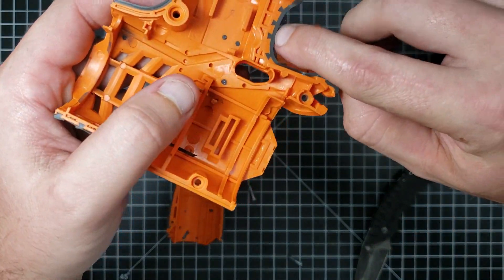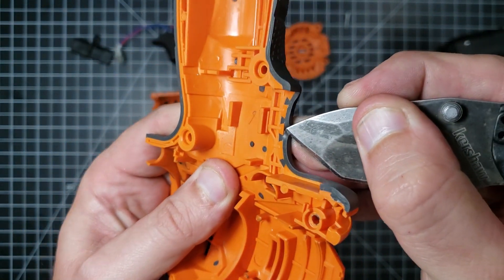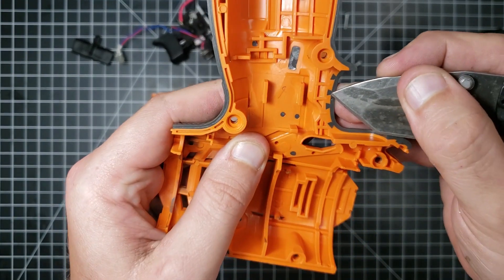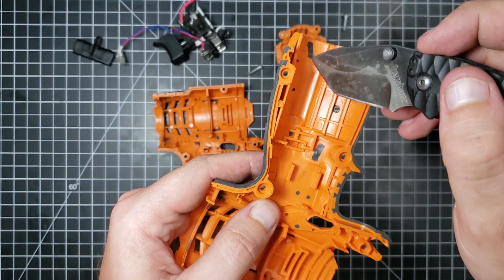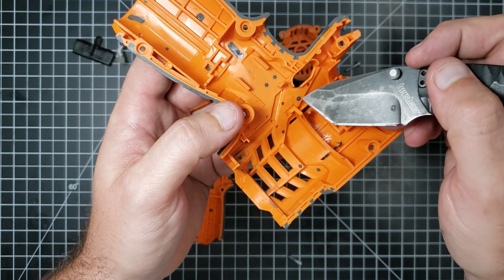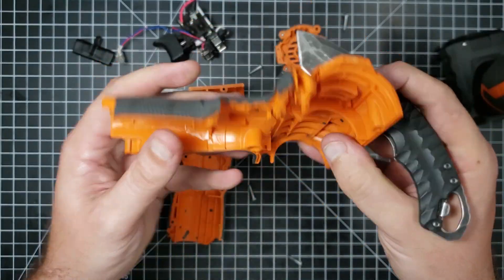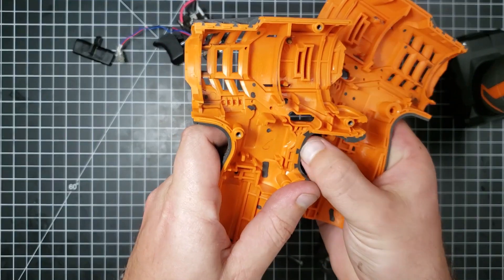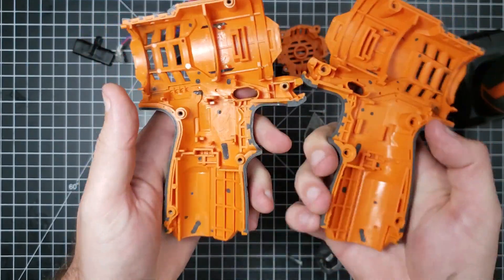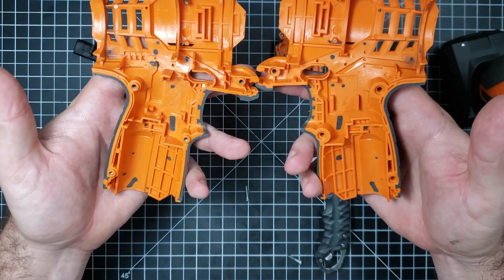You can also see the dovetails — they didn't want to rely on just adhesion. I can break that adhesion pretty easily; I just separated that rubber from the hard plastic skeleton, but those dovetails are holding it on there. You can see similar features throughout the entire part — strategic locations where they let the rubber come all the way through to make a rivet-style feature on the other side, an undercut that's going to hold it on there. So these parts can take a bunch of abuse without those things coming off. If you've seen older versions of these and other brands, one of the first things that happens is these grips start peeling off. You can see they've taken strategic design action to fix that.